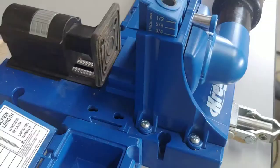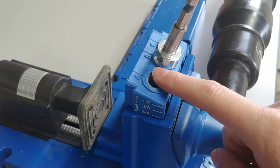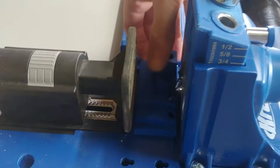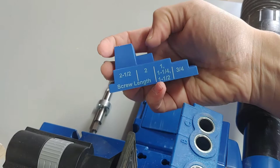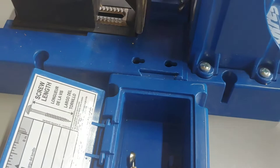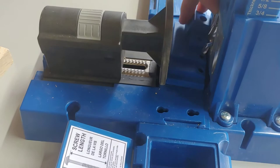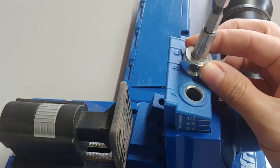If you don't have the drill bit with the markings, you'll have to do the stop collar adjustments manually. Make sure you have your drill guide block set to the right thickness. Then you bring in this stepped gauge tool. Figure out what step corresponds to your screw length — I'm using the third one over — and line that up. Then you would set your stop collar right where the drill bit stops on that step.